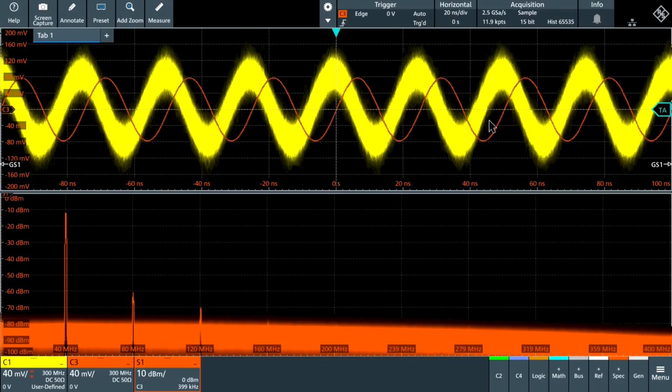So you can see that indeed the signal, the raw signal from the synthesizer, is going to look much more clean than the signal coming from the probe, because the probe has some noise added to it, but the signal is pretty small and the probe is times 10. If you look at the THD here, it's pretty good. The synthesizer does a good job, the oscilloscope does a good job. We have a very, very large dynamic range here.